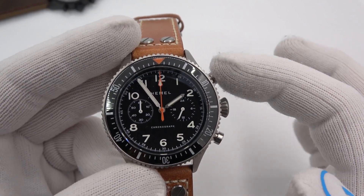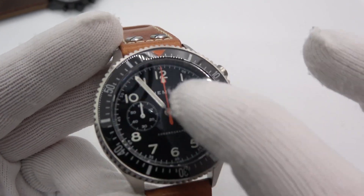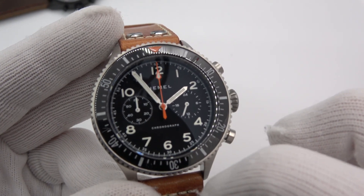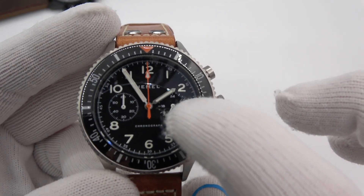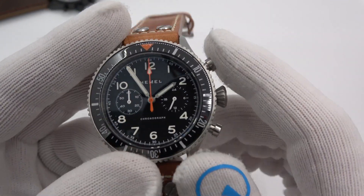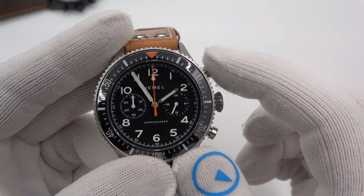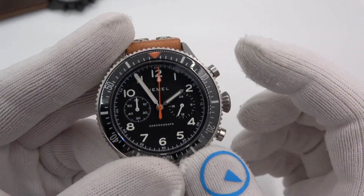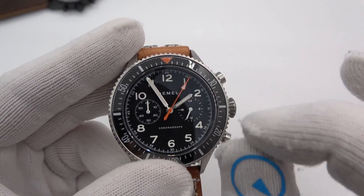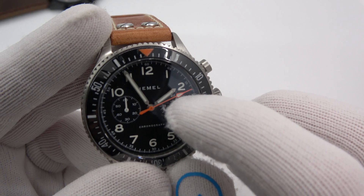When I depress the plunger here for the chronograph, the seconds hand will start moving. After one revolution, or as it starts revolving, you'll see this hand start to index to denote one minute has passed. On the right here we have a 24-hour scale — you can disregard this sub-dial. This watch does not have running seconds. I start the chrono — you hear a click. Very nice, satisfying mechanical click. The chrono elapsed seconds hand goes off smoothly, not ticking once a second, ticking multiple times a second.